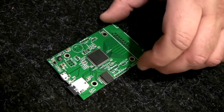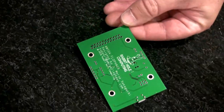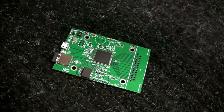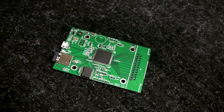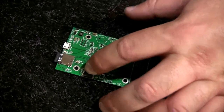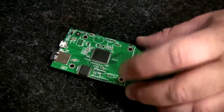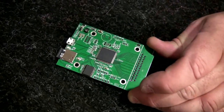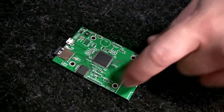It is a board that will allow you to load content onto virgin Amigas that don't have any installed OS, and may also be usable for networking some day. It has some onboard SPI flash, an SD card, also SPI, and it's based on the Cypress PSOC controller which is also used in SCSI to SD V5.